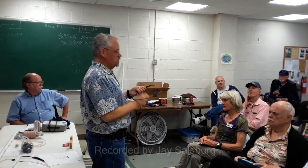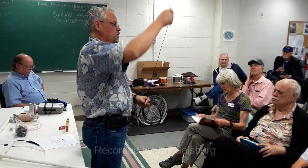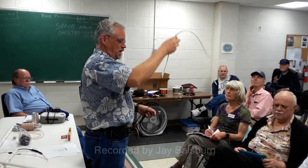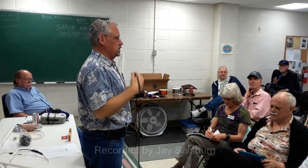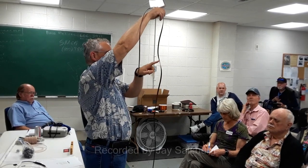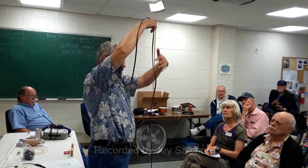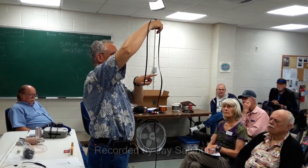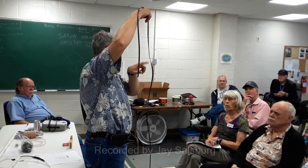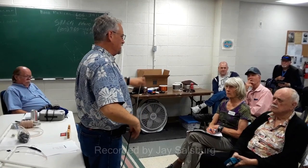One caveat I wish to make. These antennas are really not meant for higher power. On Jamboree on the Air one year, we were using a roll-up J-pole in a pipe like this, and there was moisture inside that I didn't know about. What happened is it started to burn. Literally, smoke was coming out of the pipe. We were transmitting about 50 watts, and this little doohickey right here arced from here through the piping back down to here. It was arcing on the surface inside the pipe and then hitting back here, and it was literally burning the wire back and melting the plastic. You can imagine that is not going to give you the best results. Also, the final doesn't like it either. Well, that and the radio is going to be a little upset about it too, because it's like, what's going on?